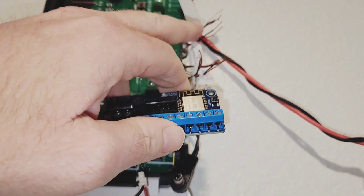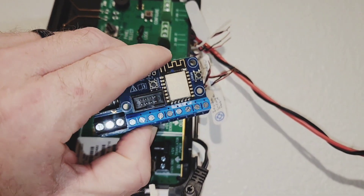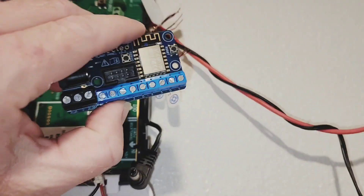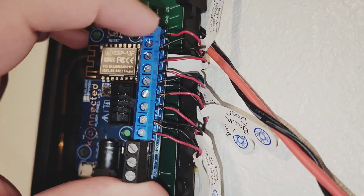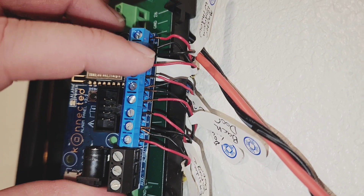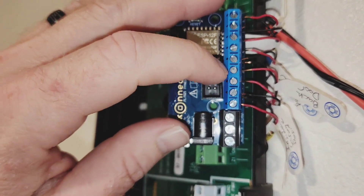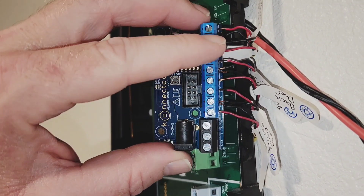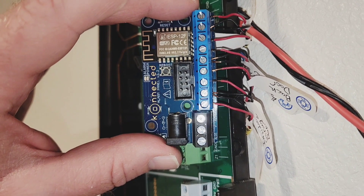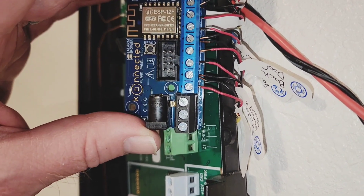When I say it shares the ground, I'll basically connect two zones — I'll put the black wire for the two zones into the G, and then the red wire will go into one and the other red wire will go into two, and so on with the other zones. I got all the zones installed. It goes red, then two blacks, then another red because I had to tie the grounds together for two zones. One thing you want to make sure you do not do is get any of the insulation pinched inside the connector when you screw it down. Make sure you see a little bit of copper on the outside. Also give the wire a little tug to make sure it's tight and not going to slip out.